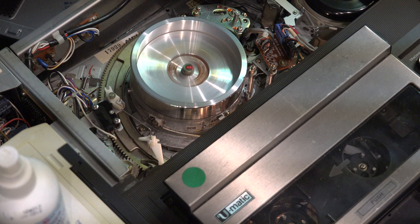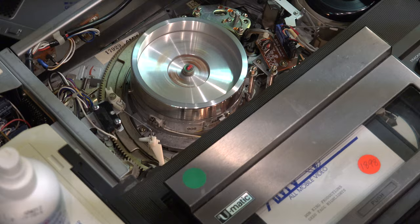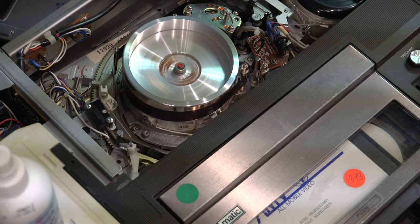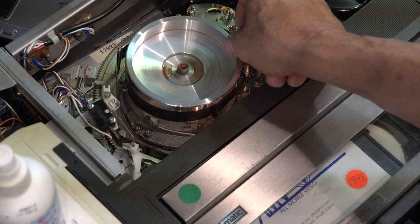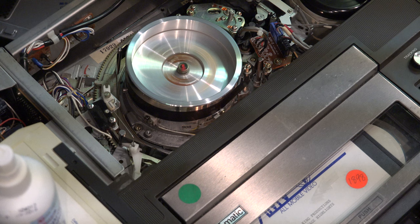That is how to clean the tape head on a U-Matic tape player. The UC-60 tapes from Sony were good — they didn't stick too much. When you go to play the tape, do one last cleaning pass and you'll see the picture gets much better. You also have controls for skew and tracking. Skew helps if the tape is starting to stick — it loosens the tensioner a little. Tracking should always be in the center if it's cleaned properly. If you don't see a picture, don't panic — run the cleaning paper over it a couple more times to remove the last oxidation from the grooves, and you'll see the full color picture correct itself.